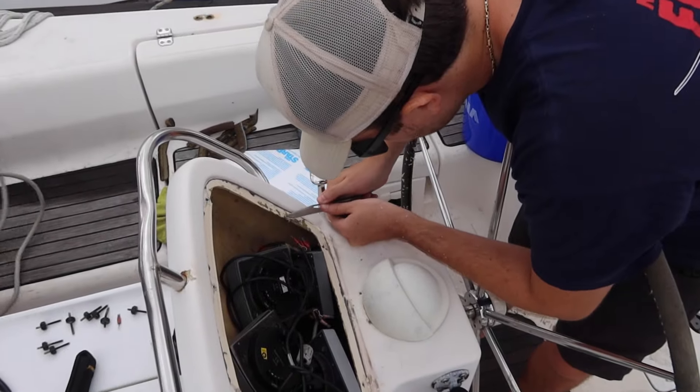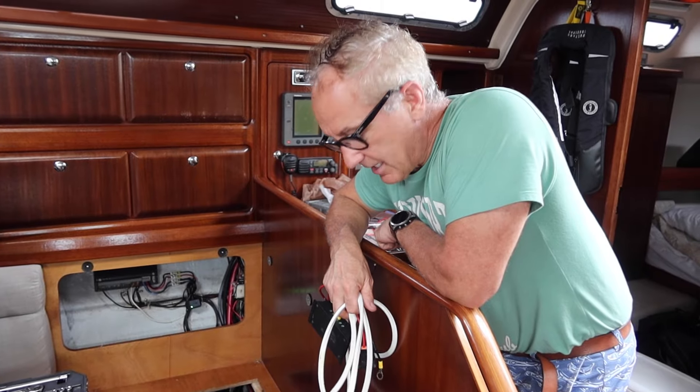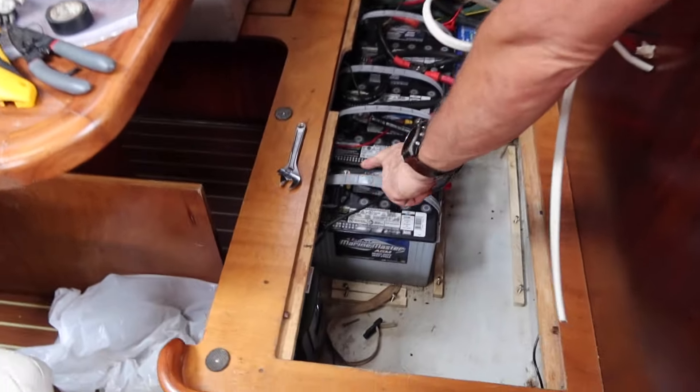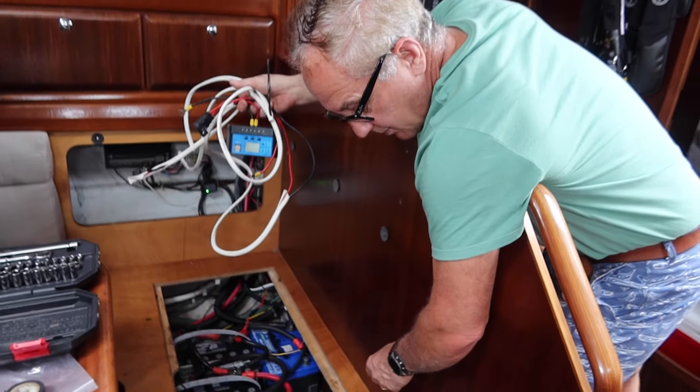Ben's working away over here, wiring in some cords — solar panel wires. We're finding a better spot for the solar panel wires to go without drilling a permanent hole through the deck, because we're not sure where we want that hole yet. Meanwhile, we cleaned up a bit of a rat's nest, took out extra wires, zip-tied everything, and mounted the controllers. We actually removed one controller as it wasn't needed. Just one more wire to run and then this section is done.